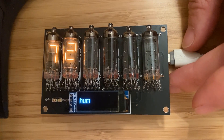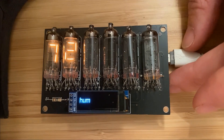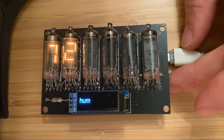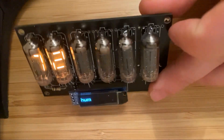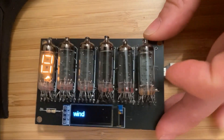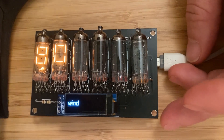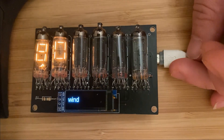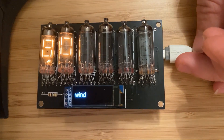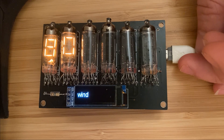You may have noticed that sometimes the top filament in one of the bulbs doesn't work. The filament's fine — it's just something wrong with the shift register, and it might have been my dodgy soldering, but I can't get under here to fix it so I'm happy to live with it. Even more hilariously, sometimes it does just randomly work as well, so for all I know it might have been working the entire time in this video. But that aside, it's a pretty simple schematic — we just have the microcontroller going into six shift registers, each one driving a single Numitron.